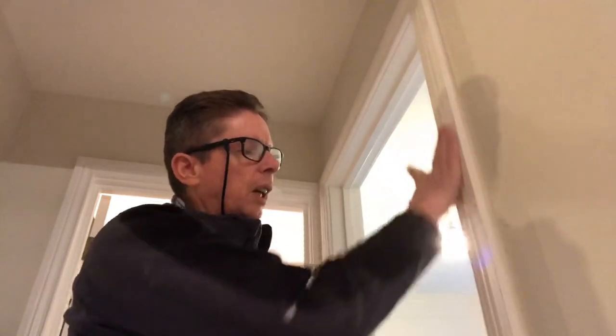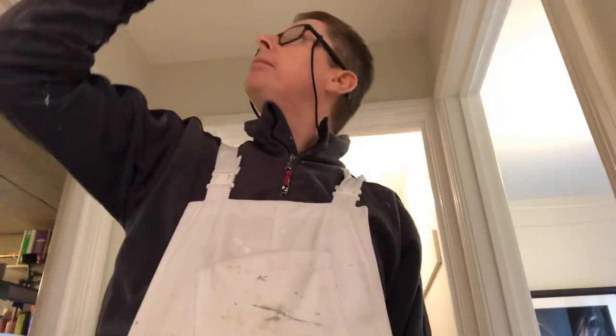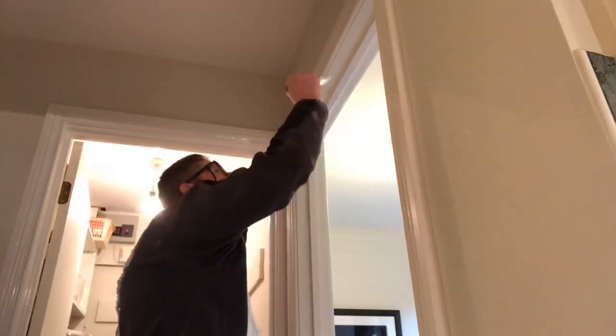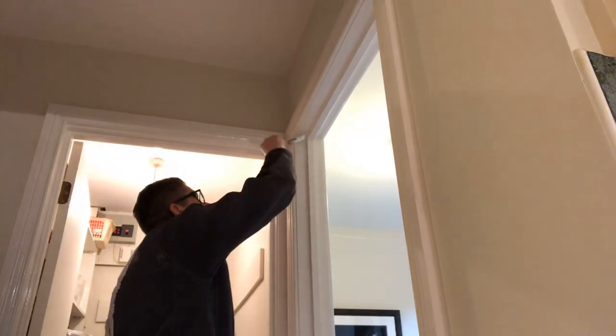These wee brushes get right into the groove. And see this primer — it sets a water-fast face, it doesn't move. You do get a nice smooth finish there for your satin. This frame behind me here, you can see over here where I put the first coat on. And the door — sanded and primed. There's a door there and a glass panel door here to do. So the seams went brilliant white. This colour here is a little green paint and the colour is Cloth Face. This is a woodwork white satin. So we do a door frame — do your top edge first. And this Colortrend Satin goes on really well, it goes on smooth, dries in lovely — a nice satin finish on it and a top finish as well.